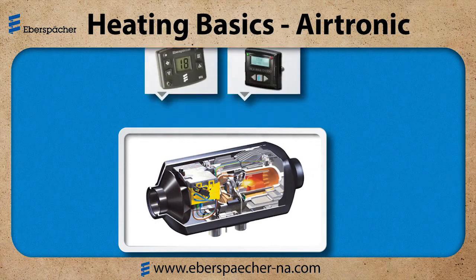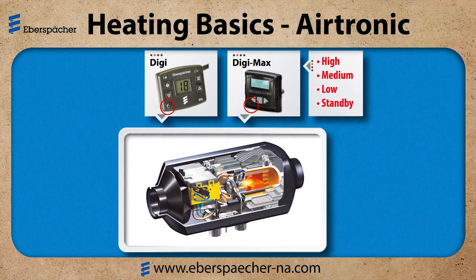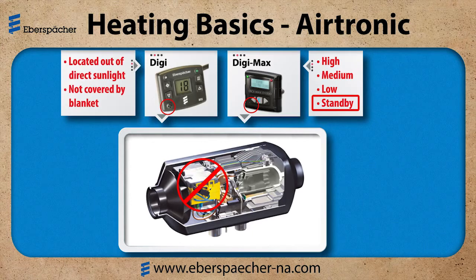Next, we'll look at the Digi and Digimax. They both have an ambient air temperature sensor built into the control. So as my heater regulates high, medium, low, and into standby, the flame goes off. The fan will also shut off because I'm reading the air temperature at the controller. In this application, I want to make sure that the controller is not located in an area of direct sunlight, or that it's not blocked with a blanket or anything like that that could give it an inaccurate temperature reading.